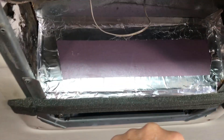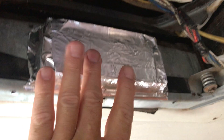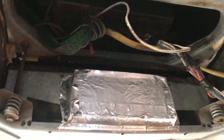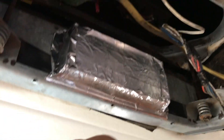On this rear unit, we took the box out and I made a block to put in its place — just a piece of foam core wrapped in aluminum tape and sealed in place with aluminum tape. Then we went through and sealed any holes we found in the box where air would be escaping into the crawl space above, so we could get more efficient airflow going both up and down.